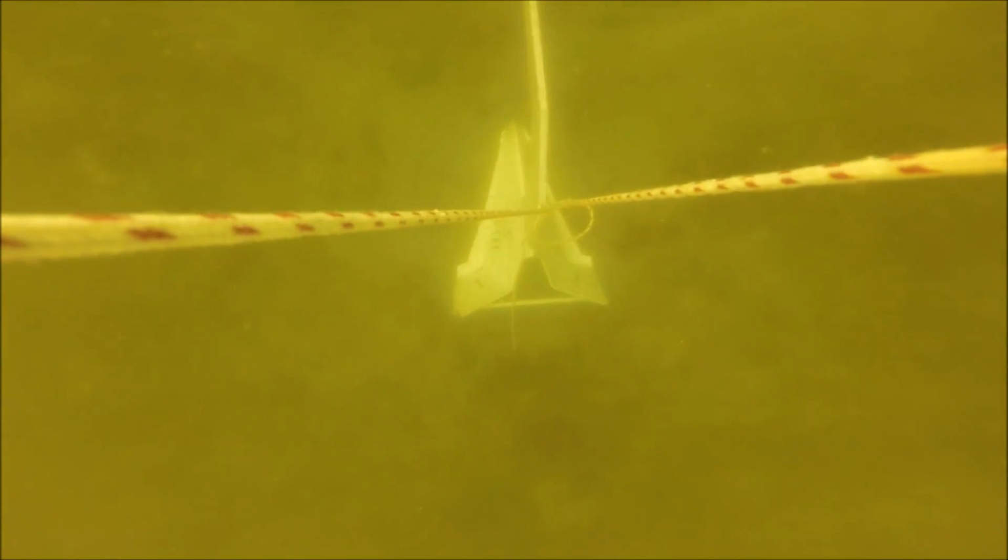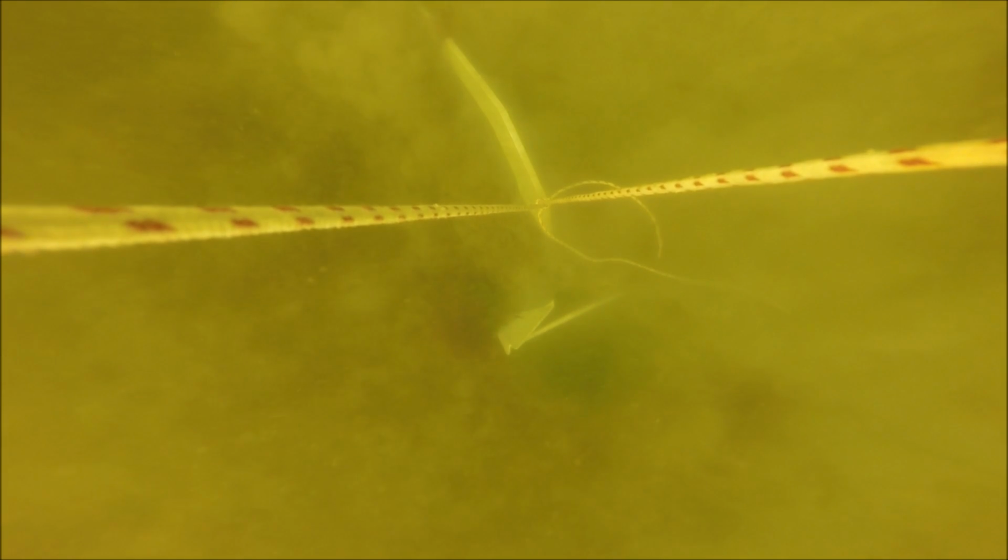Take a look. Okay, we're dropping the anchor in my standard test site, which consists of a sandy mud bottom. I'm using 3.5 to 1 scope and all chain rode. Here's the initial set with a 2-knot back down, and it sets right away, and it does hold 3,000 RPM reverse power. I'm going to cut out most of that just to keep the video short.